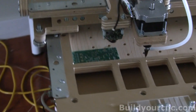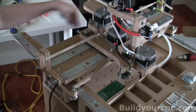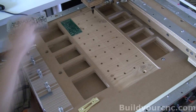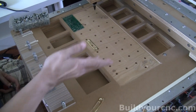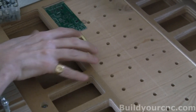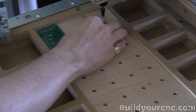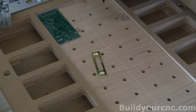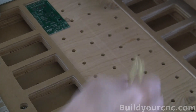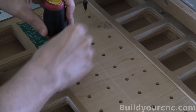The machine will have a two-sided pickup area. You'll have this location and you'll also have this location. The reels will be located here, and the reels will be located here. To provide clamping for the PC boards, I'm using this for the time being — this is actually door hardware, and it works really well that I can clamp using this. I can put in a number 8 screw and clamp it down against the board in both directions. This will actually be replaced by plexiglass pieces. What we need to do is put in number 8 nut inserts in every one of these holes.